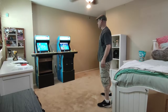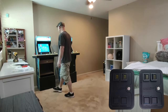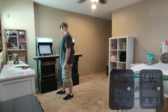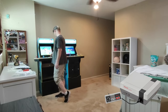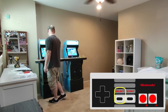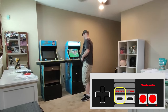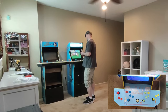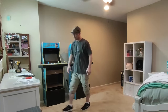Now that all of the prerequisites are out of the way, let's talk buttons. I've chosen to add coin door buttons. Some will say I should have gone with action buttons, and I totally understand — however, I think we can get greater console compatibility if we add a coin button, as it can also double as a select key on consoles. Some console games require you to use the select key to enter menus and make selections. I've got two Simpsons cabs, and if I find that I want an action key, I could mod my other cab with a third action key, which would open up three-button arcade games.